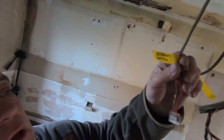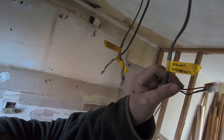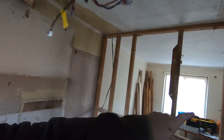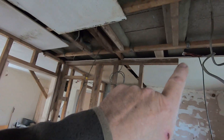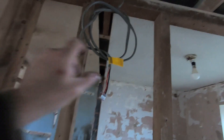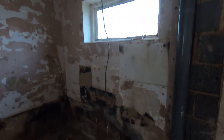I've got most of the lighting circuit identified now. If you see here, this is a bathroom switch — these are both red. This is the loop from the bathroom and this is the loop going to the living room, so that one goes off probably over there. This is the switch I've identified, and this one here is from the bathroom. I've also identified the bathroom fan and bathroom heater.